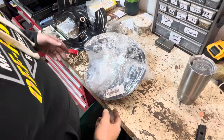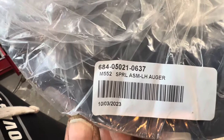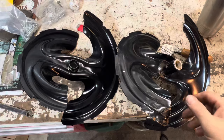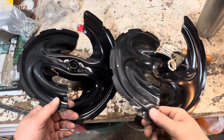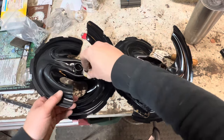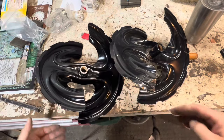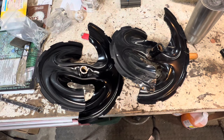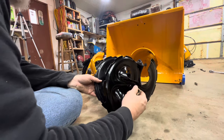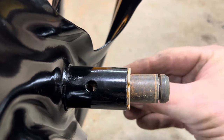I always like to compare them because this is a left-handed auger — there's the part number right there, and I'll put a link in the description. Both augers look the same except for that. First thing you want to do is pull your bushings out, then start putting it back together. Take your new auger, slide it on with the big side facing out, and put your new shear pin in.